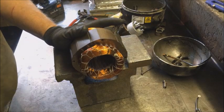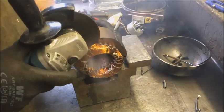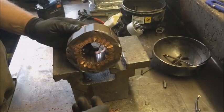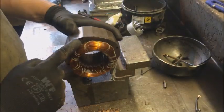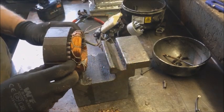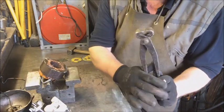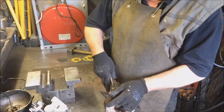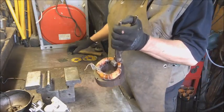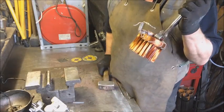The easiest way to get the copper out of these is to whiz round with a grinder. If you have a chisel next, you can do the same on that side and then punch them through. My preferred method is to take a big pair of snips, get a good grip, and bash it off.